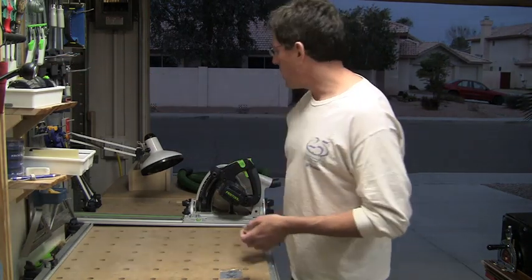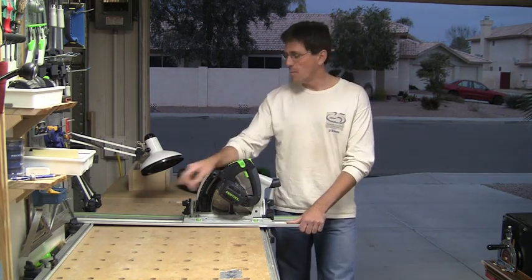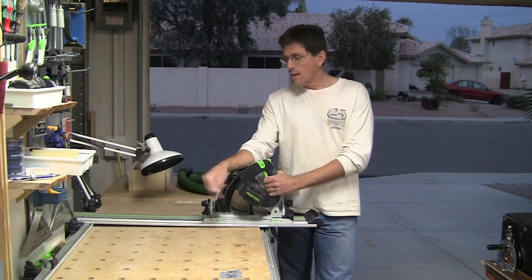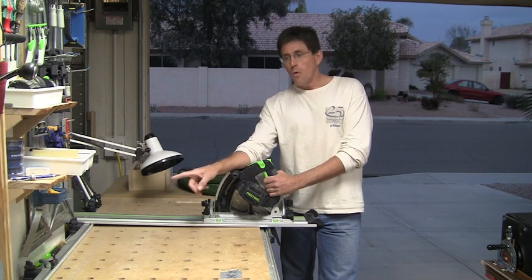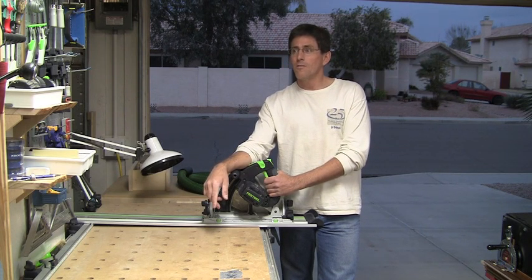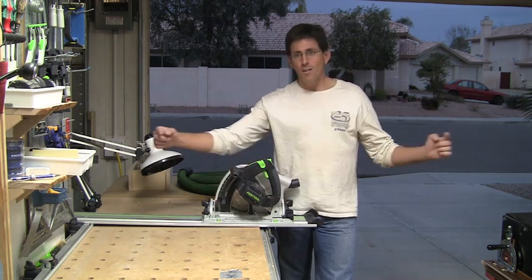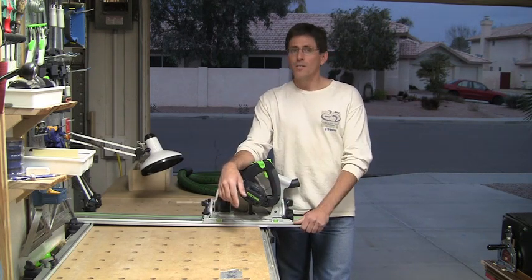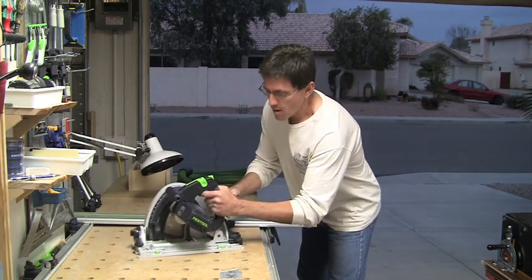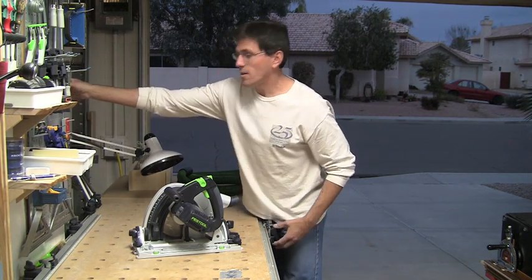There are ways of cutting miter angles on here, and some people use the miter gauge that comes with an MFT3. What I tend to find is I don't like readjusting that whole fence for a cut. I would much rather mark it — if you do a little bit of trigonometry, you can get millimeter measurements down precisely. You can easily eyeball a third of a millimeter, and if you're setting that on a large cut with a specific angle, just put the guide rail down for it. With the guide rails, you can make very nice ad hoc arbitrary cuts that are going to come out dead straight, which would actually be very difficult to do otherwise.